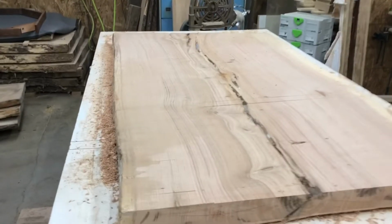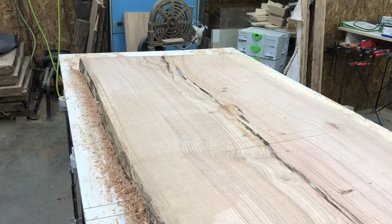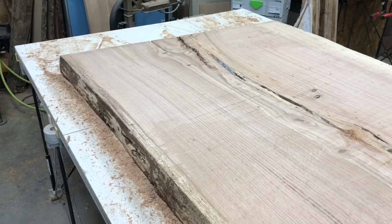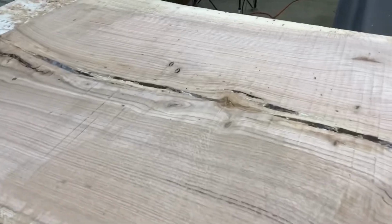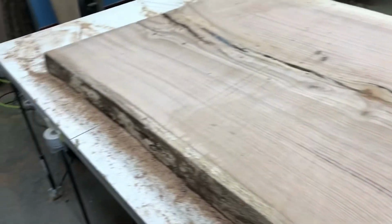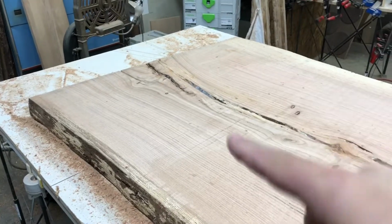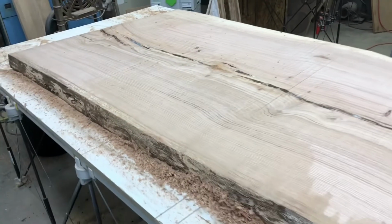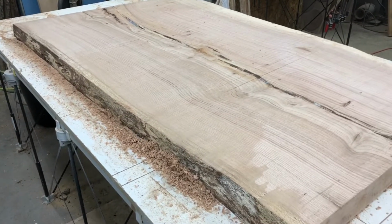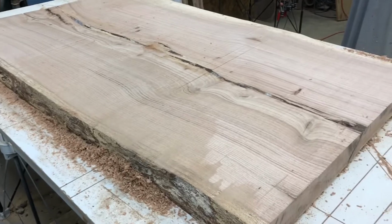So what I'll do now, this is still my A side, I will probably readjust, put my nicer finish router bit in there, and take my final pass here if it works out. So I'll take another 1/4 inch off. In the middle sections here, it was barely taking anything off, and like up there and down here, it wasn't taking anything. So I want to make sure they're all flat and parallel. I will now go to the next section, take all the way off, so I'm touching the whole work surface and taking something off, hopefully not more than 1/4 inch. Then I'll be done with the A side. It'll be flat. Then I flip over and flatten that down.